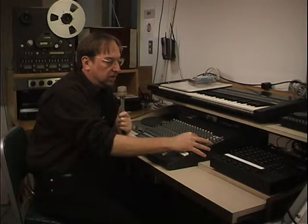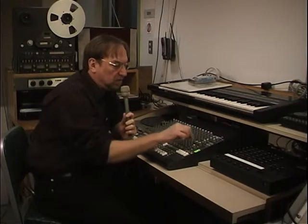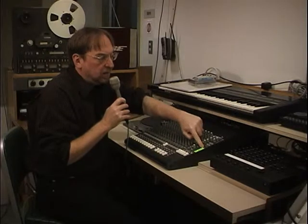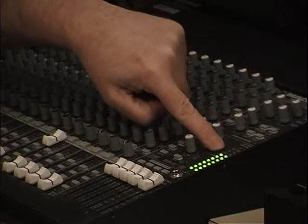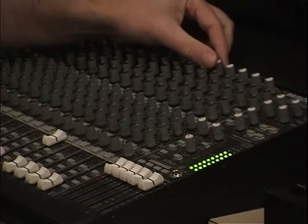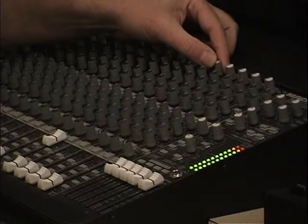The question comes: how do I know if I've got a good clean solid signal? I can adjust the sound in this room and bring these levels up to get good clean signals, but that's where this measuring meter comes in. What you want to do is make sure the volume levels are peaking at the yellow and not going above into the red area. This is a fairly good sound level — it's just peaking into the yellow a little bit occasionally for my voice. But if I start peaking into the red, that's starting to override and distort the signal.